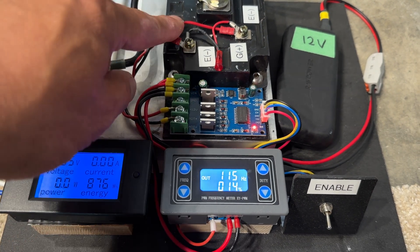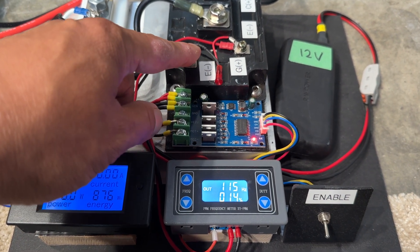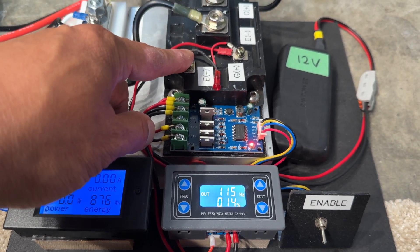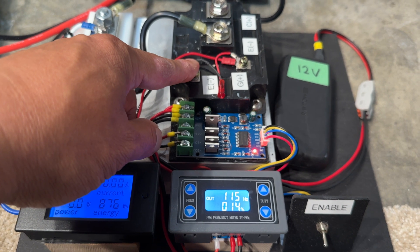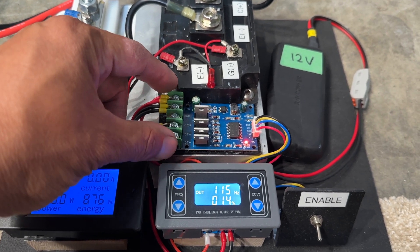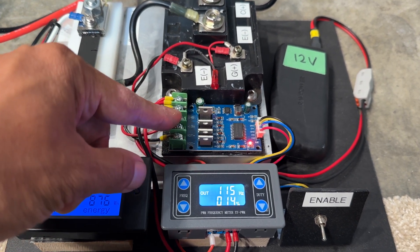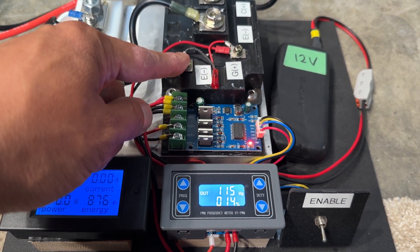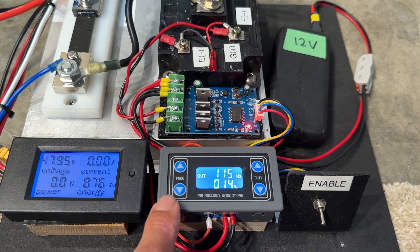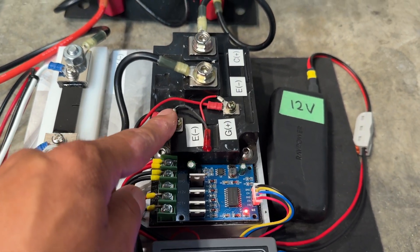The function generator can directly wire to the IGBT, but the IGBT has a lot of capacitance at the input so it's really slow to turn on and turn off. So I have this amplifier which goes in between. The function generator signal goes through the amplifier and then to the IGBT, and instead of running milliamp current, this drives it up to several amps of current which turns it on very quickly.